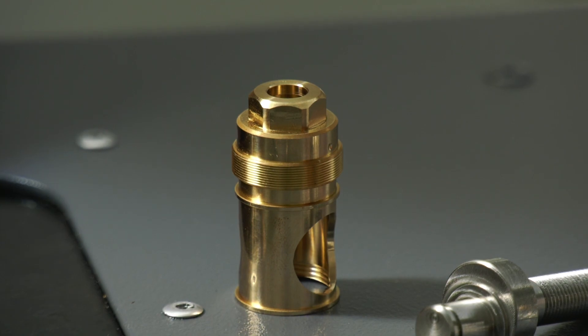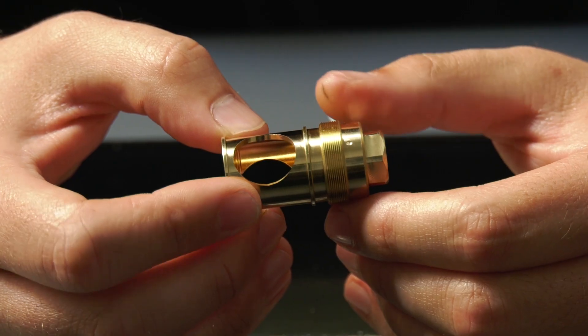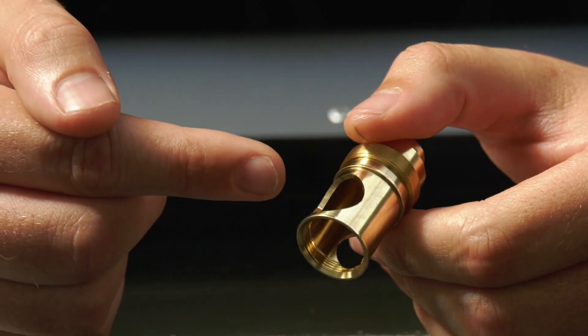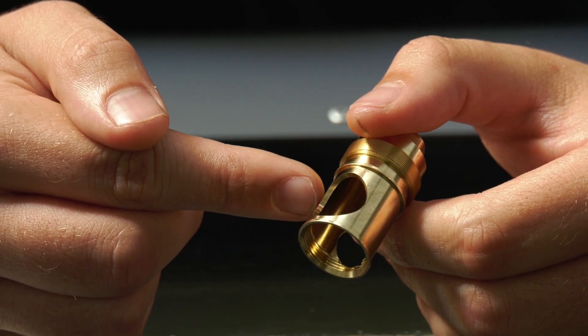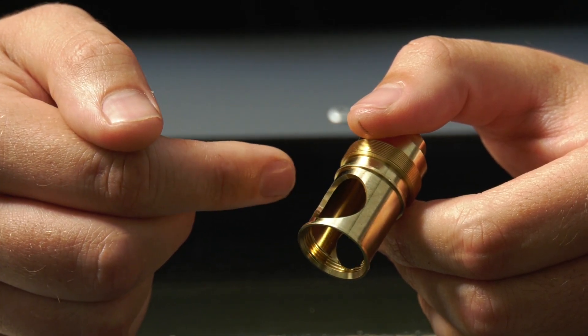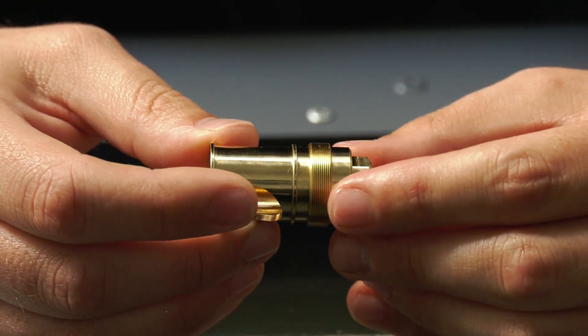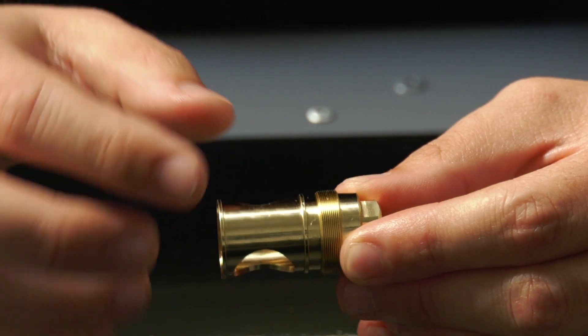I think what we should do is just talk about some of your parts, because you've got some nice parts. First of all, the bronze part — talk me through what you've done with that. So the bronze part, we make batches of 2000 at a time and we interpolate mill the cross hole in it. It's got some fine threading on the outside, a tight tolerance bore, internal grooving, milled hexagon, milled flats, and threading. The cross drilling is actually interpolated, not straight through — interpolate milled.